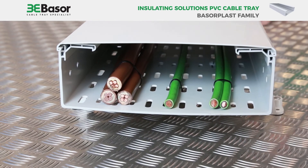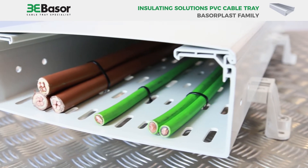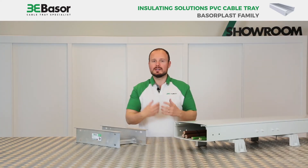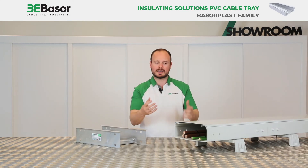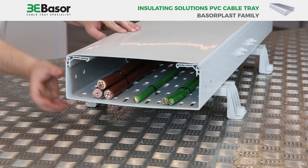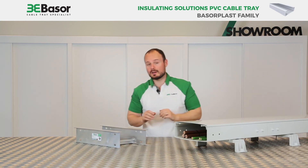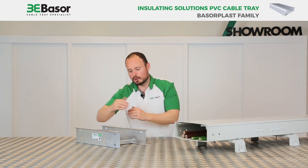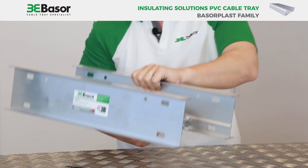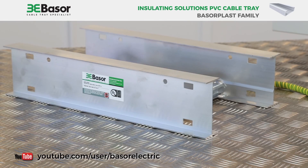Finally, we can install the cable tray with a cover, transforming it into a raceway. Compared to traditional cable ladders, the raceway is safer because it is more difficult to touch the cables — you cannot touch the cables because there is a cover. With cable ladders, while you may not reach cables from one position, you can always touch them from another angle. For this reason, we consider the raceway safer than cable ladders.